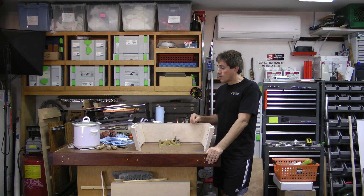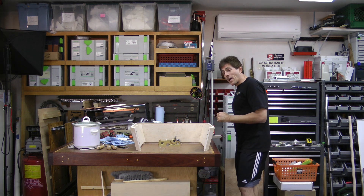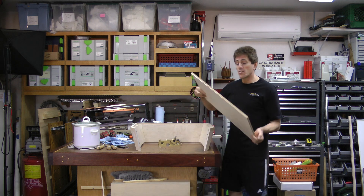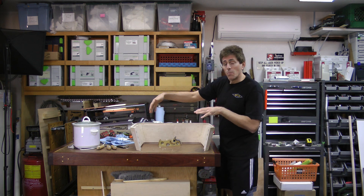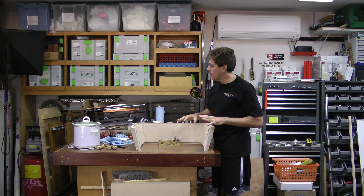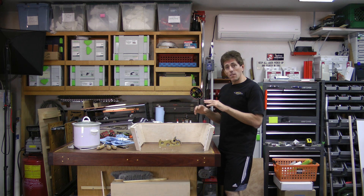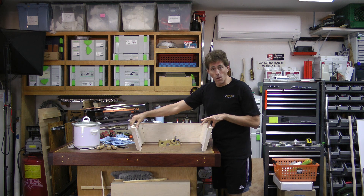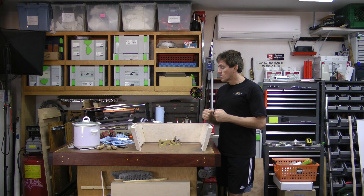Everything else looks pretty good. The first cabinet will get all the shell glued up after some sanding on the inside, then we'll cut the panel. We are going to actually build it in layers: cut the panel for the bottom and glue it in place, but leave the top panel for later because I need access to build the drawer assembly inside. We'll build the drawer assembly, get it all glued in, and then cut and insert the top panel. It's a slightly different order than normal square work, but it seems like the easiest way to work it — I don't want to be building a drawer assembly while things are loose or flexing.